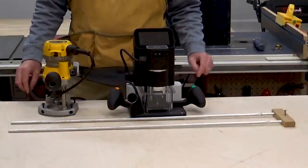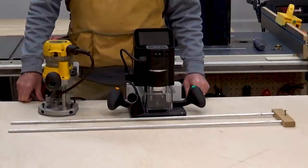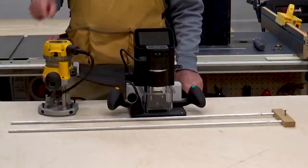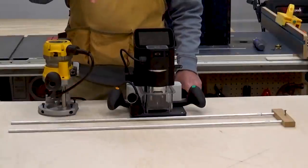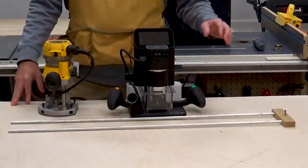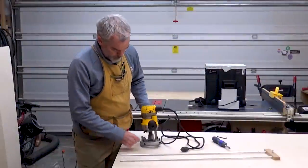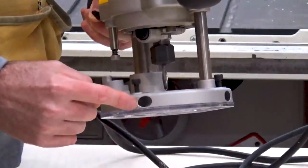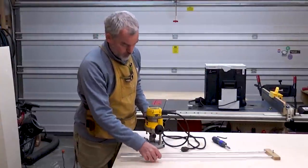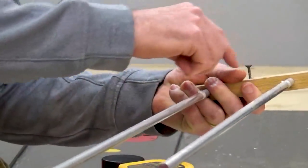To cut the clock face, I'm going to mix old school and new school power tool woodworking. This is the Shaper Origin — a CNC router built into a plunge router form factor. But first I'm going to cut out the waste on the outside of the clock face using my plunge router and this crude trammel I slapped together. Then I'll go back and cut the clock details using the Origin. My router base plate has sockets used to attach an edge guide, and I made a trammel to fit those out of some round bar stock, scrap wood, epoxy, and a screw.